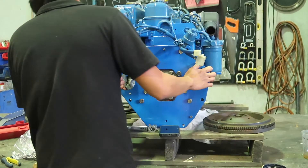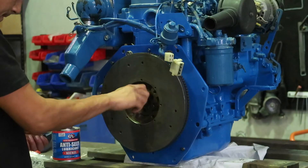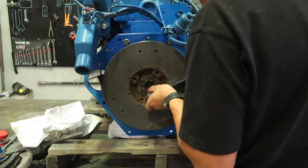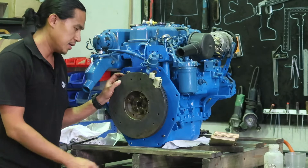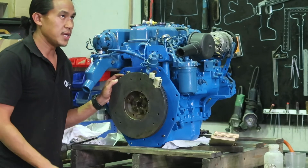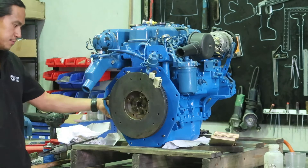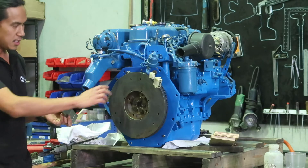So that's 60 Nm. All right, so those are now 80 Nm, which is quite a lot. I think for a flywheel you want to make sure that's really tight — it's going into a machined shaft. It would be some sort of strong steel, so I think it would work pretty well. It fits in the starter motor spot and works well for a flywheel with this.